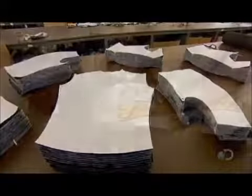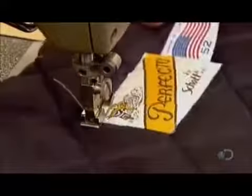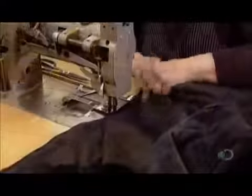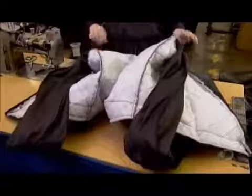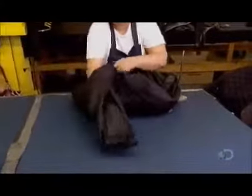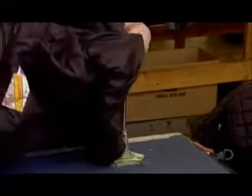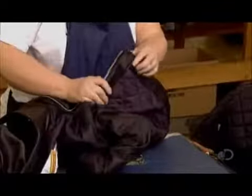In the sewing department, the seamstress pieces together the quilted lining and stitches on the label. She mates it to the now completed leather shell, sewing from the inside so the stitches won't be visible. With the job done and the off-center front zipper installed, the next worker turns the motorcycle jacket right side out. She pulls the seams of the jacket over a pointed metal rod. This gets rid of any puckers and rounds out the seams.